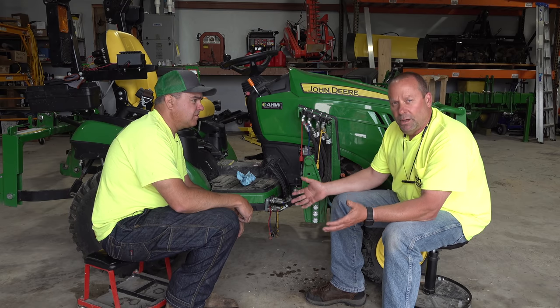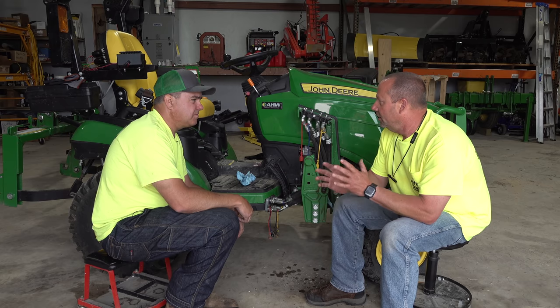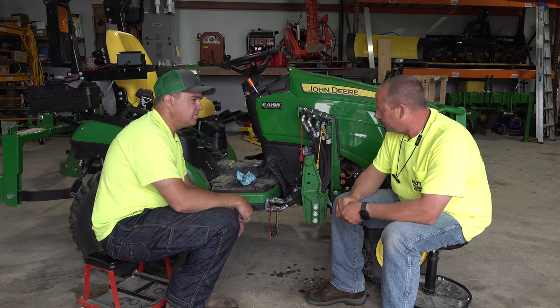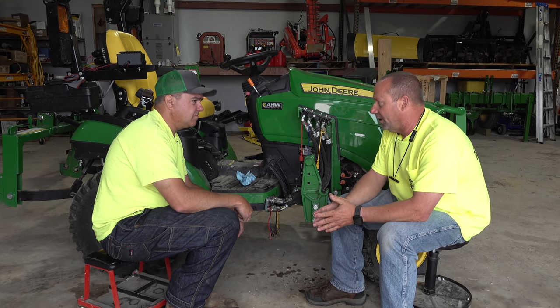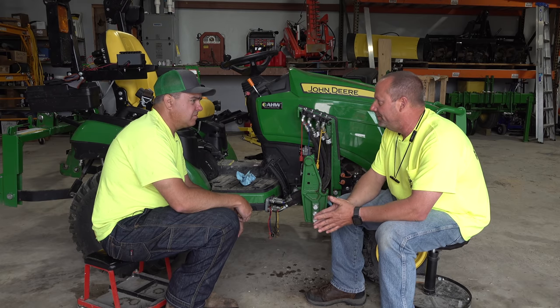You know, especially when you're mowing, there's so much dust, it's all attracted to that hydraulic oil that's inevitably on the couplers. You can't solve that. So the WD-40 is a great solvent to clean that out. It lubricates the balls just a little bit, and that's what I would recommend. I would not use a pressure washer with high pressure water, because you can force water into the hydraulic system that way.